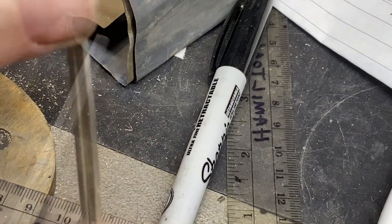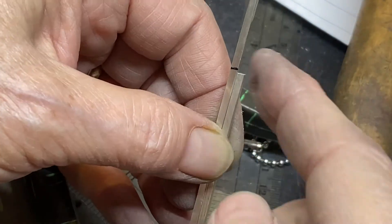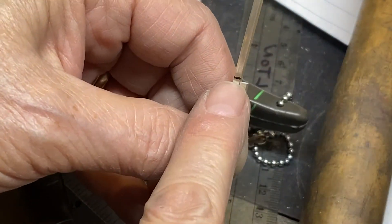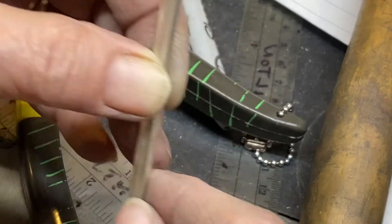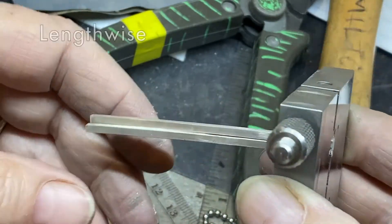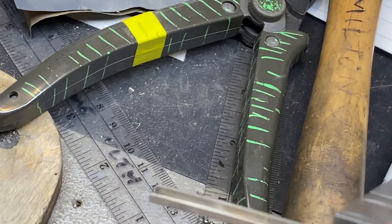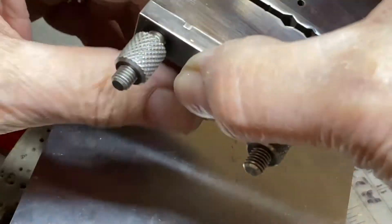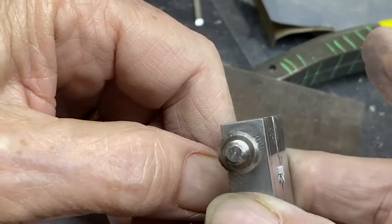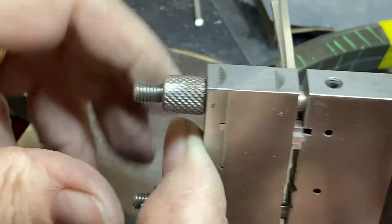As you can see, they're still a little bowed. These are lined up and the ends are finished on this one. Notice I didn't make my mark right on the line — I'm making it a little above because it's going in the vise. So if you're off by a hair, you can line these two up back here and use a flat surface to make sure they're nice and level. Then put both pieces together in the miter cutting vise.